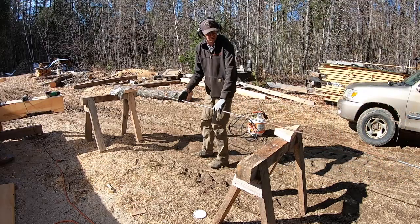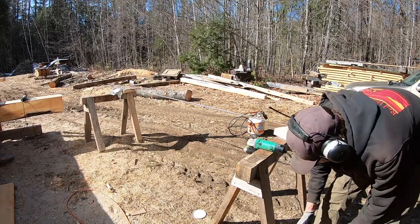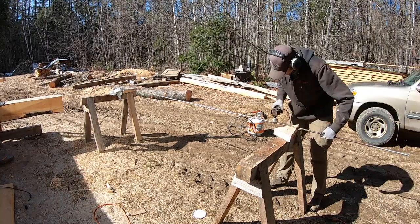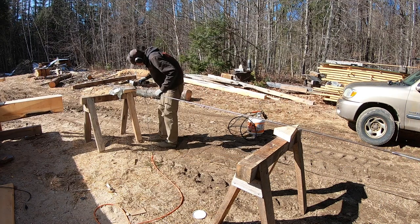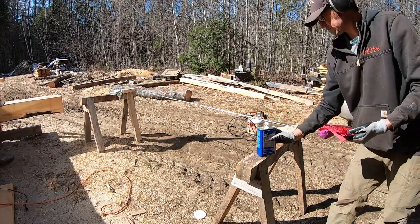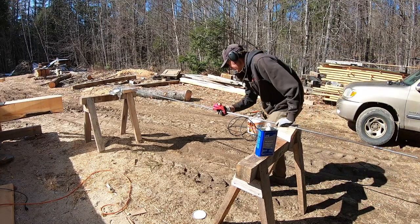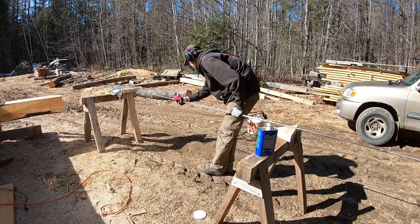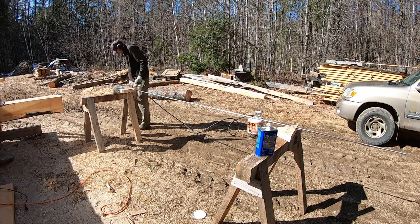So I had these steel rods fabricated, and I'll explain them more in the next few minutes in the video, but it's just raw steel. What I'm doing is grinding down any rough spots and then wire wheeling everything really smooth and soft. Then I take this brightly colored bandana kerchief and soak it with acetone, and I get it as clean as possible.